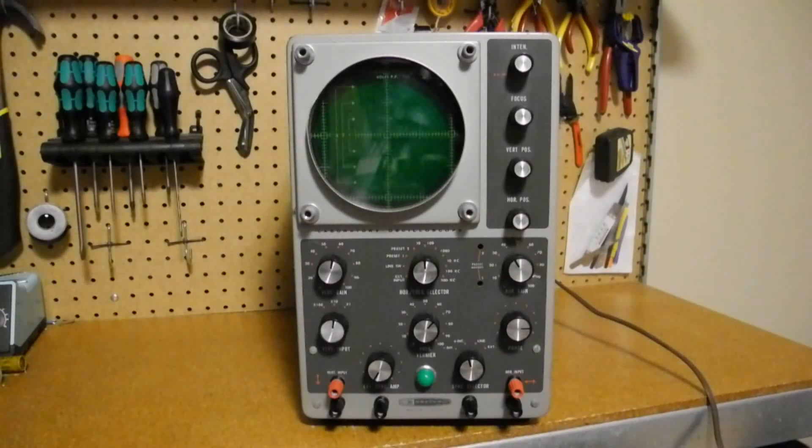The horizontal channel has a sensitivity of 0.3 volts per inch and a frequency response of plus or minus 1 dB from 1 Hz to 200 kHz, and within 3 dB up to 400 kHz. The horizontal sweep is adjustable in five ranges from 10 Hz to 500 kHz, and it also has two fixed sweep frequencies. It's not a triggered sweep like more modern scopes, but uses a recurrent sweep with a sync circuit that synchronizes the sweep generator with the input signal, which has to be repetitive. There's also a Z-axis intensity modulation input accessible from the rear panel. The scope has a built-in power supply running on 105 to 125 volts AC at 50 or 60 Hz, weighs 20.5 pounds, and uses 11 tubes including the CRT — some are dual tubes, making it equivalent to having 18 tubes.